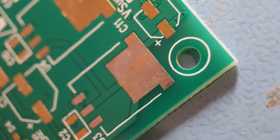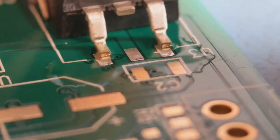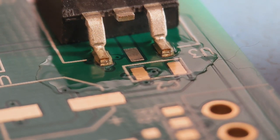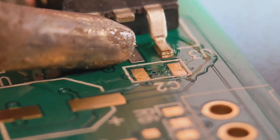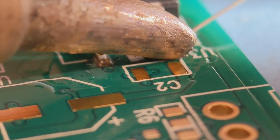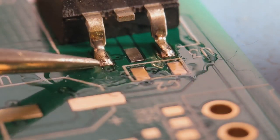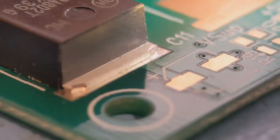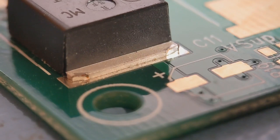I've put the component on and I'll show you how I soldered it up. A little bit of flux. I'll slide the component into position and get these two generally soldered up. The middle leg on this component isn't actually used — you'll find some of these do have the middle pin missing. I've got to change my iron bit for this; I've got a rather large one to help with the other end. I'll get it central and solder these up properly. You just want the solder to run around the sides and around the heel, with quite a nice amount going up the sides right round to the back of the heel.